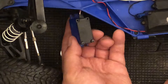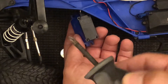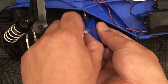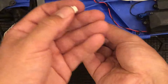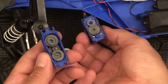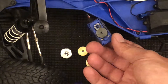In order to open it up you will have to remove these four screws. Use a Phillips one — that's what I used. Once you do that, I decided not to remove the servo entirely. Take this little gear cover right here, put it off to the side, and it will pop out just like that. In here you have all the gears you're going to be replacing; you can just go one by one.